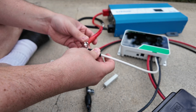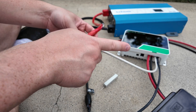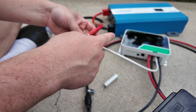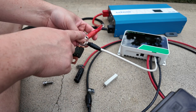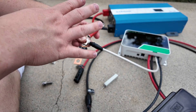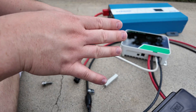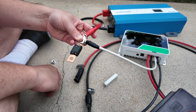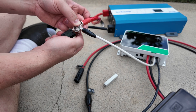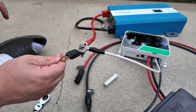Be sure that you get the correct wires and that you know your polarity. I don't have a red wire for my charge controller, but I know that white is positive and black is negative. Take your time — there's no need to be in a rush. That's where most people mess up. Make sure all your connections are tight.